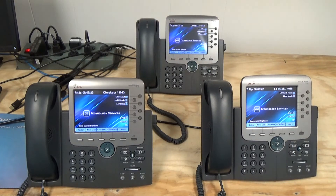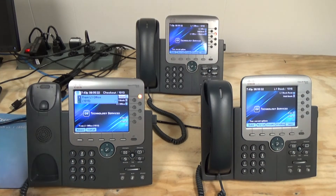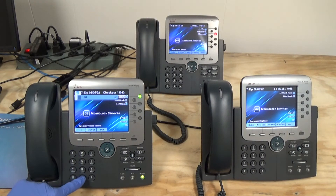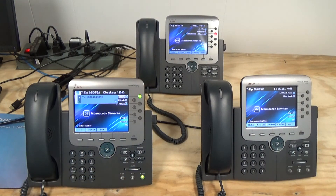That was just a quick little show-and-tell — we were able to get these phones working on FreePBX with Chan SCCP and SCCP Manager. They do interoperate with SIP phones that are on the same network, like the one on the other desk, which is a SIP phone and it's working just fine. Let's do an outbound call — outbound calling works.